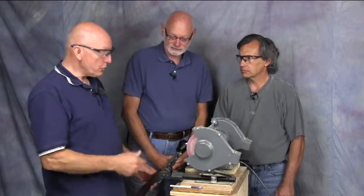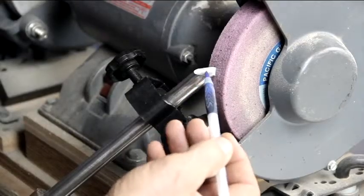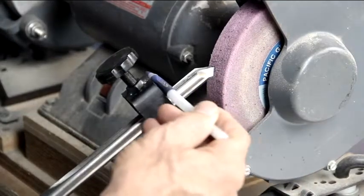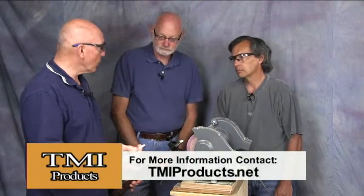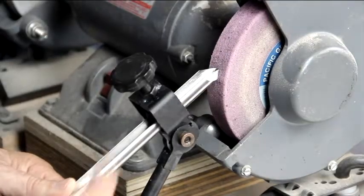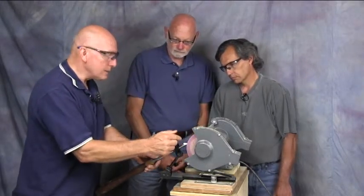We're going to take a look at our basic gouge sharpening system. To begin with the setup, there's a notch that I line up with a hole that gives us this basic bowl gouge shape — it's a good basic grind for a lot of general turning. I need to get the tool at a uniform distance out from the face of the bracket to the end of the gouge. The exact distance isn't critical, just that it be uniform every time. I also slide the arm in or out by unlocking it to get the bevel to lay on the wheel — if I have a steeper angle I move it in, if it's more blunt I slide it out. That's just to get the bevel on the wheel, not how I change the shape.